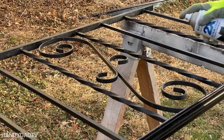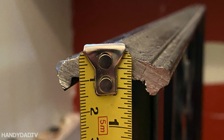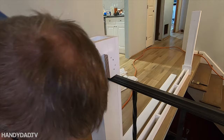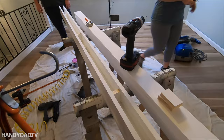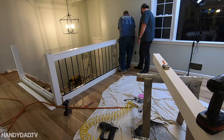The size of the inch-and-three-quarter spacers came from the size of the top railing, which is an inch and three-quarters wide. I made the spacers so that the top rail would fit over them by five-eighths of an inch. The top rails are made exactly the same way as the bottom rails — three 1x4s with spacers between them. I put a spacer on each post on each side, with spacers in the middle, and a little dab of construction adhesive to make sure the railing doesn't rattle. Then they fit over the top and get attached with nails.